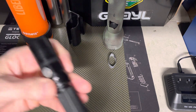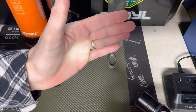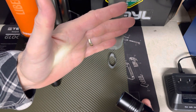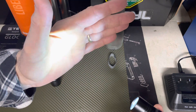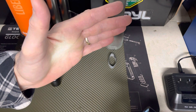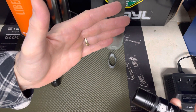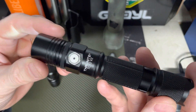You can see here — I'll put it up against my hand — when I cycle the light on, it'll start out in low mode, or book light mode, or moonlight mode as they call it. Then it's supposed to cycle through low, medium, high, then turbo, etc. However, it goes to what I think is like a medium, and then it goes back to moonlight. It just cycles moonlight, medium — it's supposed to cycle through all those modes, but it's not doing it.